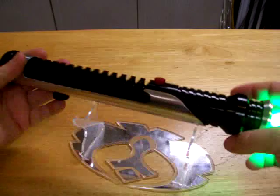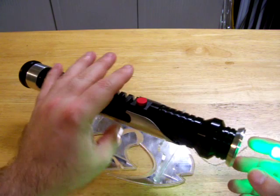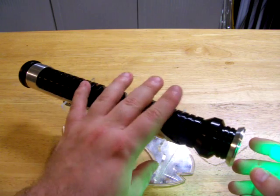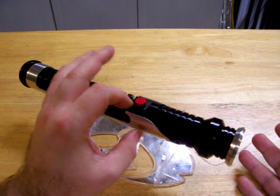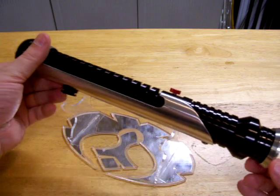The flash on clash is white with this LED. Another feature is that if you're just tapping it or around the button when you're using the saber, it doesn't turn off — you have to actually hold it down. And that is an actual variable setting; you can set it in the config file too.